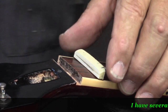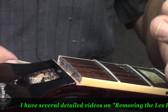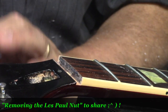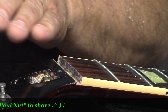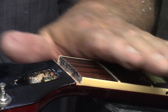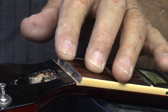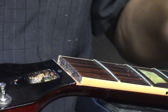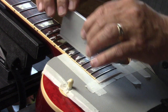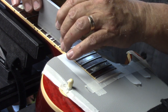For any of you Patreon subscribers, just send me a note if you'd like to see how this job is done. This came out obviously super clean, not a speck of wood, right on the glue line. We're going to set that aside now, and one of the reasons we take that nut out is we want to be able to check along the trajectory of the string path completely from the first fret to the last. So we're doing a compensated nut on this one anyway, so I decided to take that out as we get on to leveling the fingerboard. So we used our short straight edge and we basically found all of the high spots that need to be taken care of right at the neck junction or just before it.